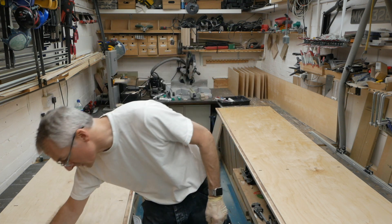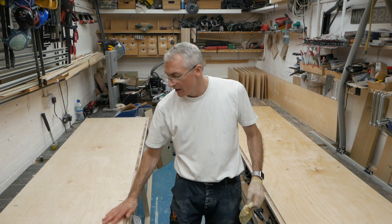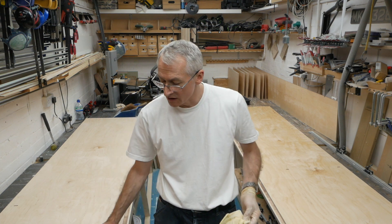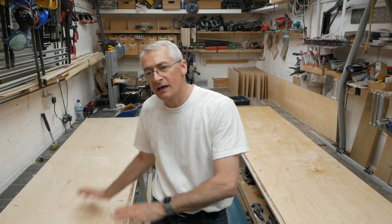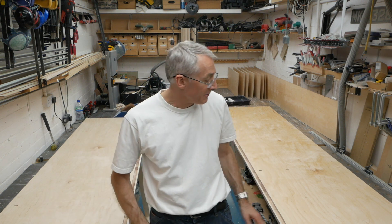This is actually touch dry pretty much already now. It really soaks in fast on the first coat. It brings the grain up nicely and then we can rub that back again, sand that right back - it'll go super smooth. Then we can get a second and third coat on, and the second and third coats dry much faster with a much faster recoat time. But for now there's not much I can do until all this lot dries, so time to call that a day and pop back either later or in the morning.